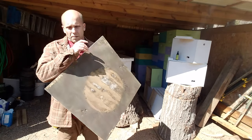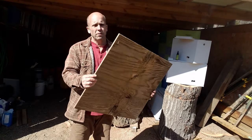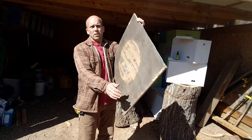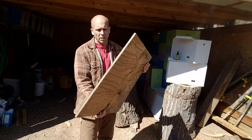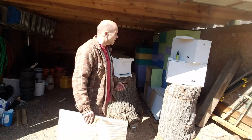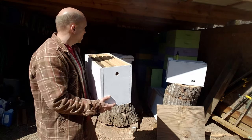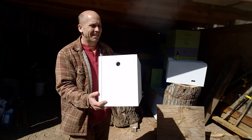I used the standard dimensions. I went and got some 2x2 plywood sheets at a local big box store — they're cheap, about five bucks a piece — and I used three-eighths inch plywood. It's 24 inches square, so I cut it 24 inches across, making it 24 inches deep, then cut it to the proper length which is 19 and 7/8. I had a couple of 1x10s laying around and made the fronts. It's pretty simple. This one cost me about $15.